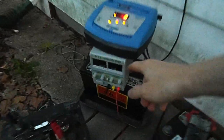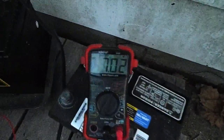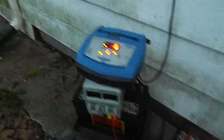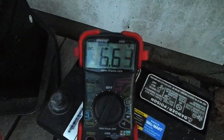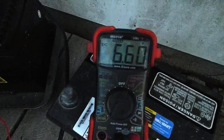My universal power supply was a little bit too slow, so I started charging it with my regular charger. I'm charging at 15 amps, and it's taking 15 amps to get up to 7 volts. It's been charging for about 12 hours at 15 amps, and that's more than enough for now. Let's do the next discharge test to see how much the desulfation circuit has helped, or if at all.